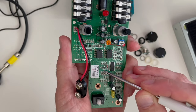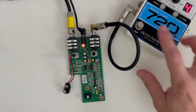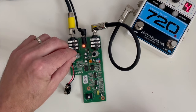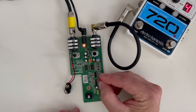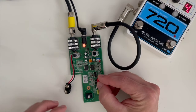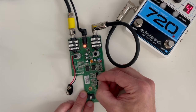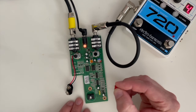Let's just test that real quick before I go in and start soldering. I'm going to go ahead and start the loop, and we can hear I've got that rate turned up pretty high. I've got my capacitor here, and I'm going to touch the capacitor to C18 and it should slow down. Okay, so you can hear that's definitely slower. And I'm back to fast again. Okay, so it works.